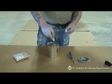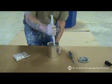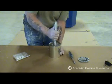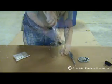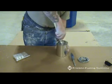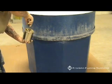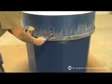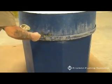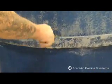The putty and catalyst mixing ratio is 20 milliliters of catalyst per 1 quart of fiberglass putty. When mixing putty and catalyst, always mix from the bottom up. Mix until the catalyzed putty is thoroughly and uniformly mixed with no color streaks. Resin hardens quickly, so have all set-up items prepared ahead of time. Spending extra time on set-up prior to mixing the resin will help ensure that you have enough time to work with the resin before it hardens.